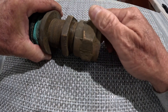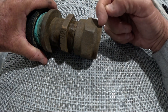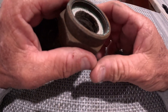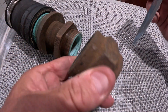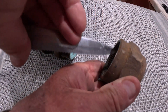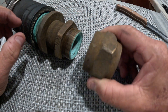We screwed it all the way in as far as it would go, pushing this first row of stuffing all the way back. This particular nut is a little larger and it has three rows of stuffing in there — one, two, three. This one also does not have waterproof grease on it, so eventually it's going to turn into that black packing that we pulled out originally. We also had that tool in there — since the shaft was slid back, the pick tool was able to get in and dig out all the old packing all the way around, hook it, and pull the yarn out. Then it'll flop around the shaft.